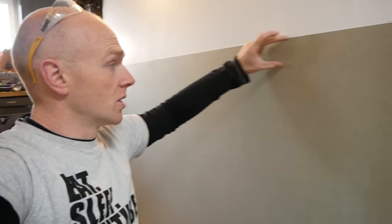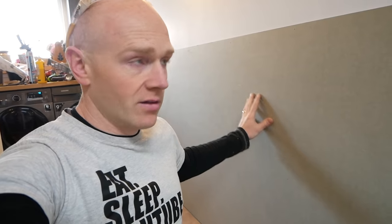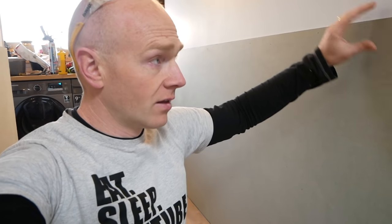Remember, the top section here, we're going to have a rail. We're going to have skirting board down the bottom, and both ends are going to be covered. So you could almost work out exactly where everything's going to go, and that way you haven't got any holes to fill. But you know that you're safe. Top 85mm, the bottom 150mm or so, you can put everything in there. But obviously, think about where your cables and pipes might be.